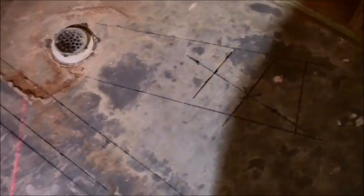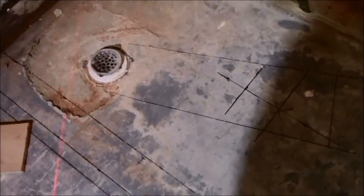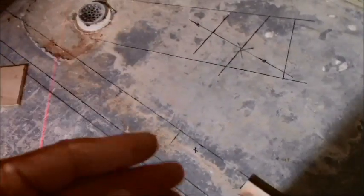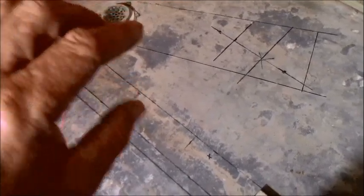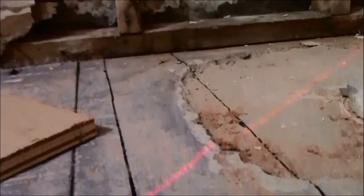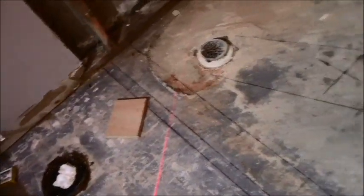It's unfortunate because this is the most difficult part of this shower build. The most time consuming, because once I've done that drain, glued everything in, got it to the point where I want it, then all of that dirt has to be backfilled, and then that same concrete has to be poured. And then this is kind of boogered up. It's a little higher ridge over here, so I got to kind of knock down that ridge so I can get everything flat. And that will be my curb eventually going across. So yeah, this is the beginning phase.